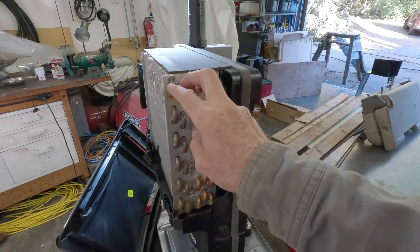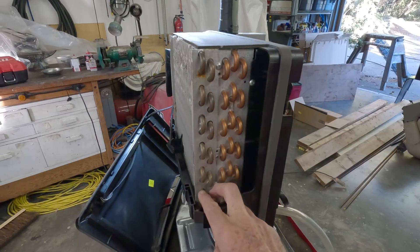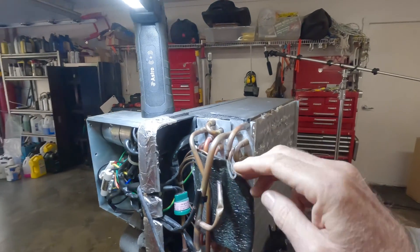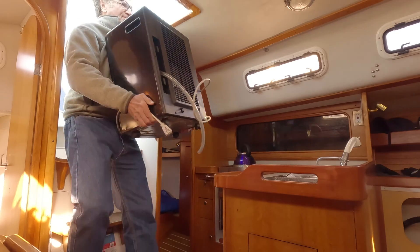In this video we'll describe various strategies to remove surface mold in a boat. We'll take apart a dehumidifier and show the details of how it works, and we'll walk through a practical solution to overwintering a boat in locations where moisture is a serious problem. If you've grown tired of using bleach compounds to wipe surface mold off of your boat, then this video is for you.